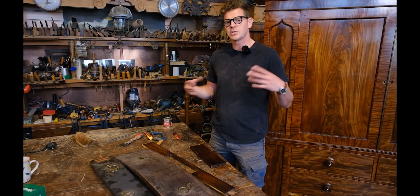There are lots of elements to veneer repairs, but we're going to start with veneer choice. We reclaim veneers off old pieces of furniture, and the age of the furniture is very important - the period and the quality of the veneer. On a piece like this, we don't want to be putting veneers on that you have to hide under wood stain. You don't want to darken a piece of furniture to hide your repairs. You want it as light and as natural as possible. If you can spot a slight color difference but the veneer quality is there, it's a job well done.